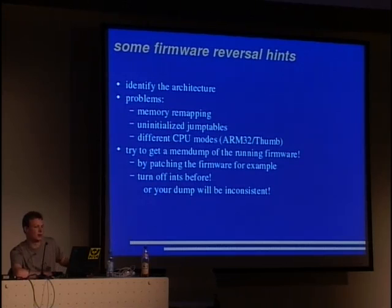But the ARM also starts at entry point 0, so you usually have the ROM bootloader at the same location. So what you do is you remap the RAM, or some kind of RAM, to this location, write your interrupt vectors, and it works. You won't see this easily in the firmware unless you have analyzed the complete remapping code.